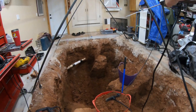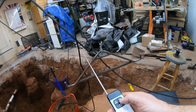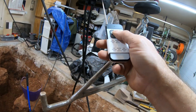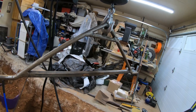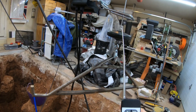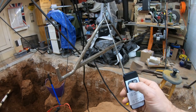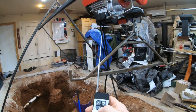Activating the aerial - and down, and stop. Wonderful. This little switch right here is actually the limit switch: when the hoist goes up it'll automatically stop, but you still have to push up to engage it. This contactor mess over here will turn on that contactor. If you try to go down from the top and keep pressing up, it'll keep going - and the stop button actually works. With that, thanks for watching, have a great day, we'll see you guys again soon.